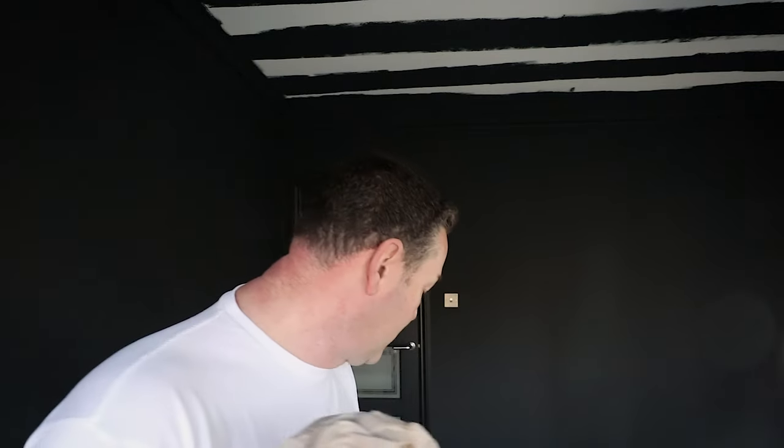So what I've done, when I measured this room up, I've allowed on the sides and on the length, 2 inches salvage, which on the whole is 100 millimetres, so 4 inches. That allows two inches either side as a salvage. That is plenty. But because these lengths come in a panel, they come in a roll. They come in one big roll and each section is cut for the length that you require.